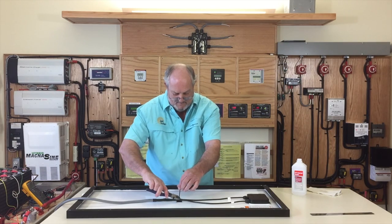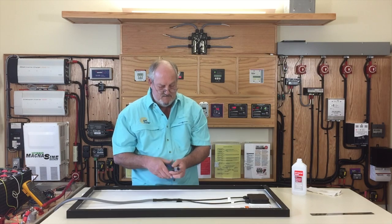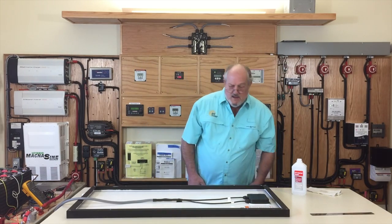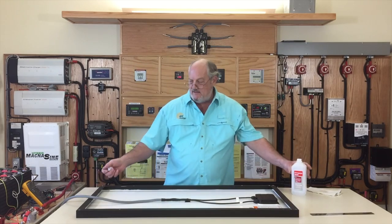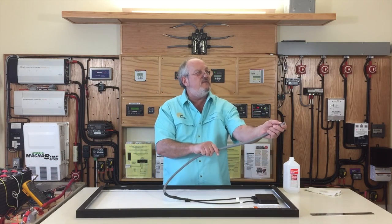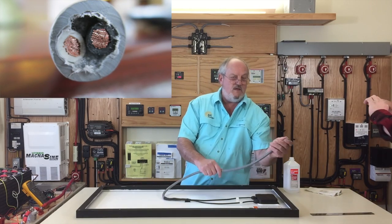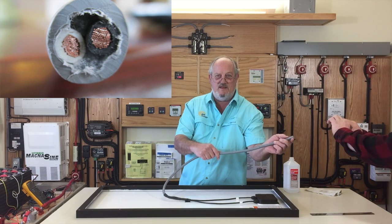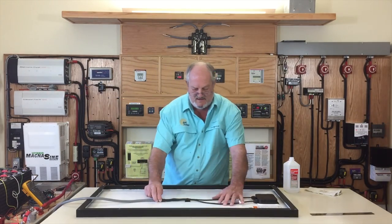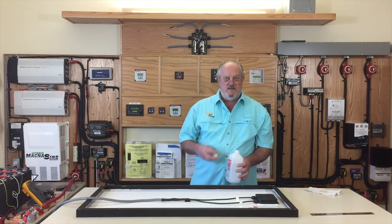I like to take a nice pair of flat-sided side cutters and cut the zip tie off clean so there's no sharp edge. If you use the bevel type you'll leave a sixteenth of an inch of really sharp plastic that can cut your finger. When we ship out a system, each panel has 15 feet of this kind of wire. You can look in the end and see there's a white jacket with a number 10 conductor we use on the roof, and then there's filler on either side that keeps it nice and round. This is how we send out prepped panels — our next step is putting on our mounts.